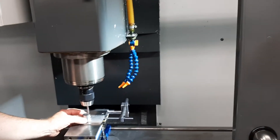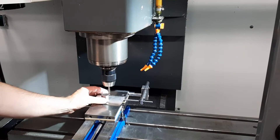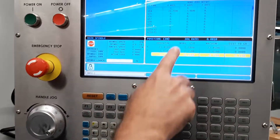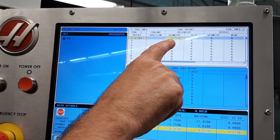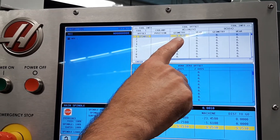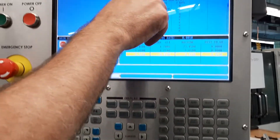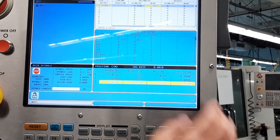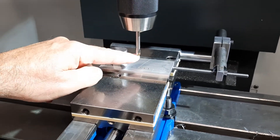It just slipped, so I'm going to go down one again until it stops and then go up one. It just starts slipping underneath, so that's right where we want to be. Right now we're one inch above — we're not actually touching the part yet. I'm going to push the tool offset measure, and it put the geometry offset of negative 9.753. That's how far down the tip of the tool is from the home position. But I've got to account for the fact that that block is an inch thick. So under the wear offset for that tool number, I'm going to type in negative 1.0 and enter to accept it. That shifts the zero down from here to the top of the part. The reason we use this block is so we don't damage the piece when we're setting up.